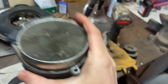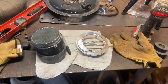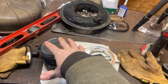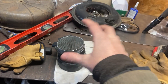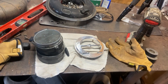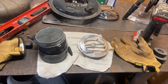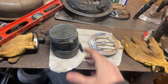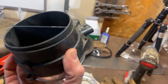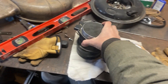I'm going to see what I can do to modify all this so that it can fit. This is your MAF sensor — it measures how much air is coming in and the temperature. There's a little nub in there. The big dilemma is you're supposed to have space in front, and if you think about air turbulence it could read wrong because the air is just kind of floating around instead of sucking straight in. You're supposed to have like two or three inches on both sides of that.